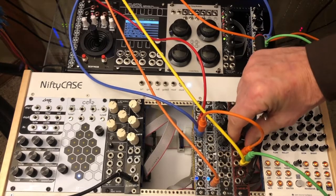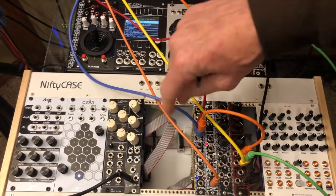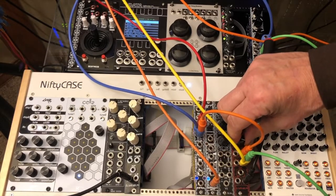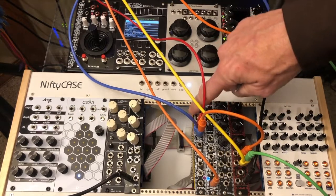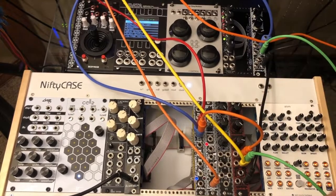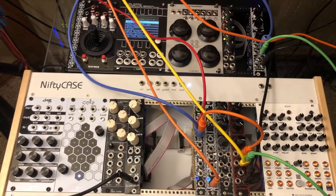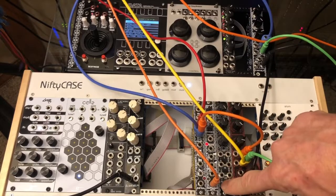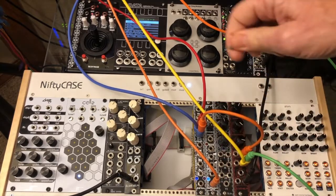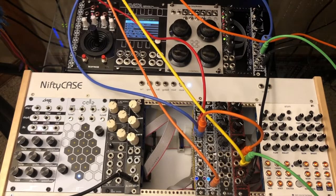which is attenuated right here. So you can attenuate that envelope in, and that's this orange and this blue. And that is the sample and hold out. That's going into the envelope in. And then finally, entropy out is gone over into the Dixie 1 volt per octave. And so the entropy out is a random CV, and that's how we're getting these random gates, because it's speeding up and slowing down the Dixie. It's in LFO mode, if I mention it.